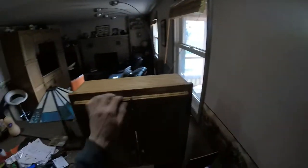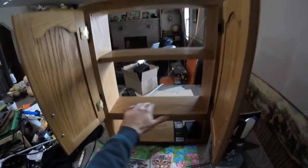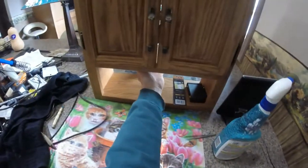I don't want nylon inserts, but I know that I'm going to catch somewhere in here at least a center for my mount point in this custom oak cabinet. So somewhere in there, I'll have to pre-drill a hole. Then I can do a couple nylon inserts to keep it from tipping. Put another brace on the back side down, just like that one. And she'll be sturdy. This is very heavy. It's completely solid. I still have to put the back on it.